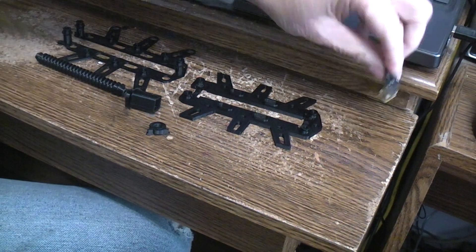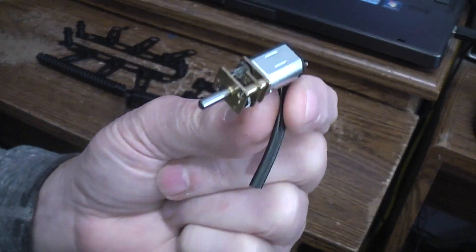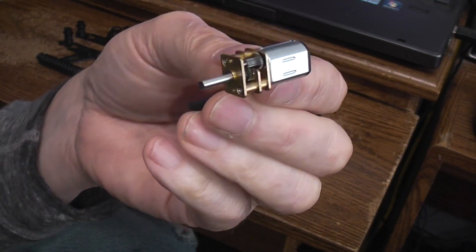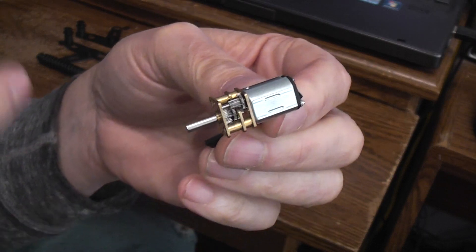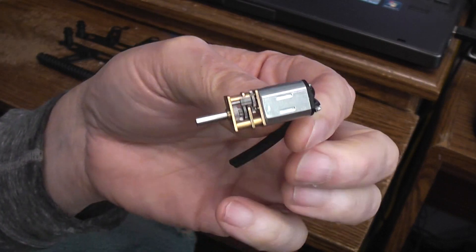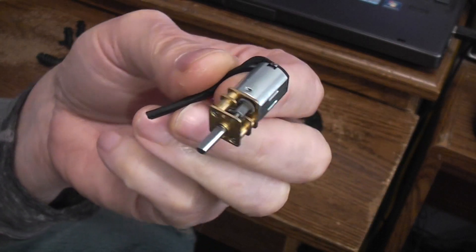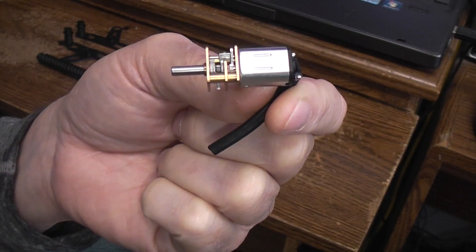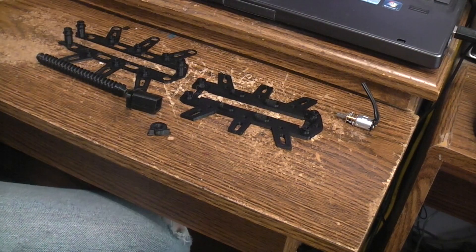To address all those changes, I decided to go with what's now available: the very small N20 style motors. You can find these everywhere, but I ordered mine off Amazon because there are sellers that sell them in as many as ten different gear ratios. I didn't know what gear ratio was going to be right for this project, so I actually ordered four or five, all in different gear ratios. In the end, I found that the 1000 RPM worked the best. You could even go a little faster if you wanted.